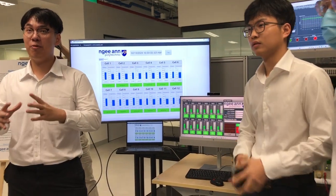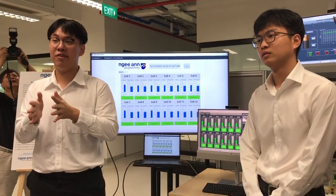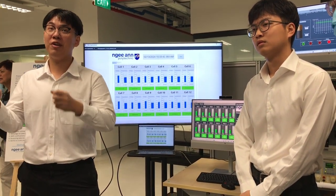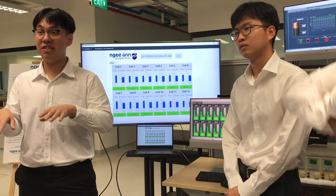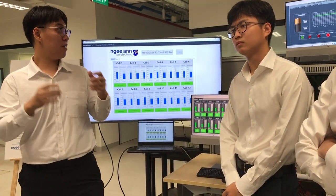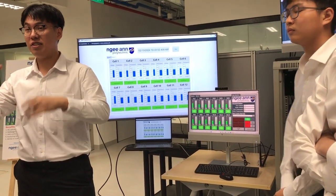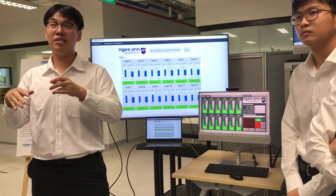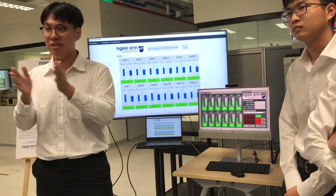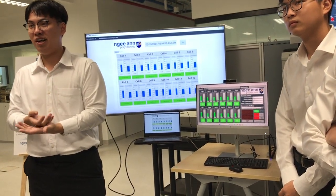Usually a battery is made of many cells, right? With different cells and different characteristics, also maybe similar characteristics. But for us to do repurposing of batteries, we know maybe it's an old battery, so we need to test each individual cell to see whether it is in good condition or has similar characteristics. During the cell discharging, we can find the discharging curve. Once the characteristics are matched together, we can recombine all the workable cells together and make a second-hand battery as a storage system for solar.